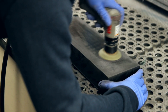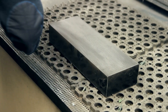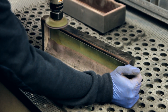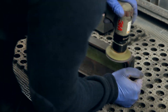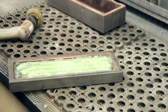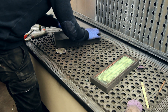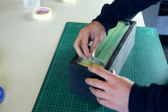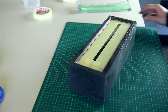Now it's fully flat on all sides. Then it's just a matter of sanding the entire box to get it ready for spray paint and a bit of Bondo later on. Keep in mind not to sand through the weave — this is the most delicate part. You have to make sure you don't go all the way through the carbon fiber weave, or you'll see it as a visual defect.